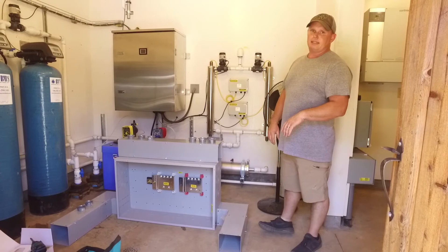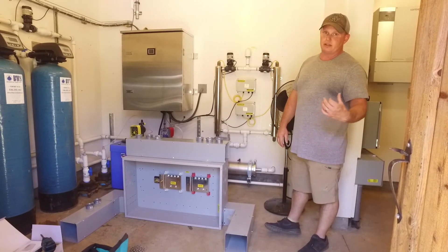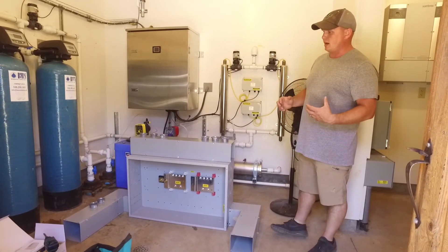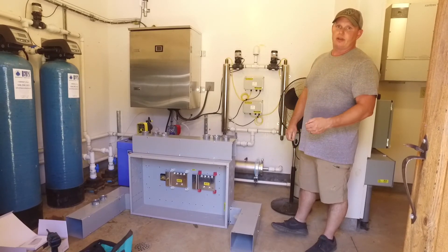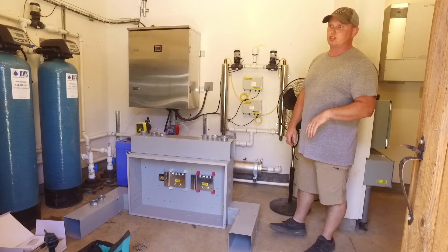In the next few years we'll probably upgrade this to a full bank of lithium iron phosphate. You can see behind me we're getting ready for lockup — we're going to add 24 L16 AGM batteries for the time being in the existing rack. We also want to add another inverter so we can run the hydro directly through an inverter and pretty much make it a digital battery charger.